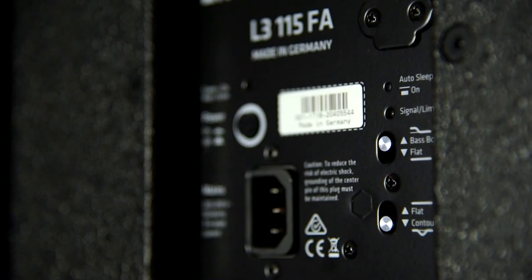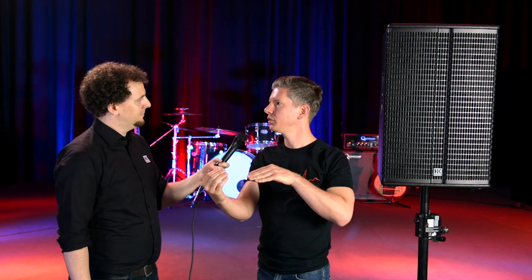If you don't have a sound engineer, these Linear 3 speakers are perfect, because you have four different EQ presets you can use — just press a button or two buttons in combination, and you've got your perfect sound straight away. Even if you use it with a sub or without a sub, we've got two flat EQs — one for the low end and one for the middle frequencies. If you're in an acoustic band, you need the full flatness of the middle sounds to be very present for the vocals, or if you use it standalone, a little bit more bass — you need some boost in the bass.